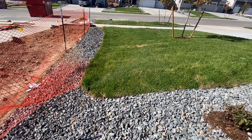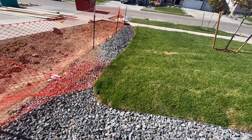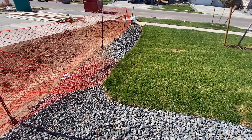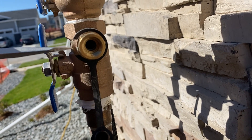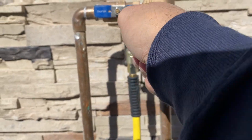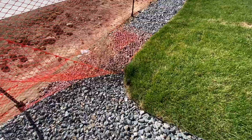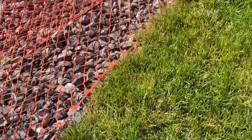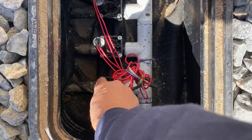I reference that back with the drip line as well, using sound to figure out when the drip lines are totally empty. As you can see, the sprinklers are going, pushing water out, and starting to push air out. For the ball valve — when your screwdriver has the line parallel, it's open; when it's perpendicular, it is closed. That's how I turn the air on and off to the system and let my compressor recharge. Here's the system after cycling through it two or three times — you can see nothing is coming out of any of the sprinklers, which lets me know that line is blown out.